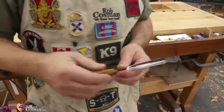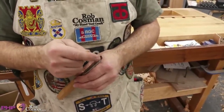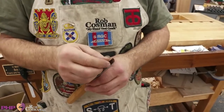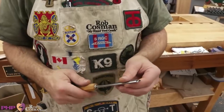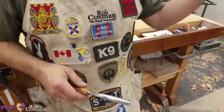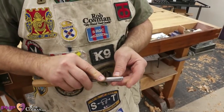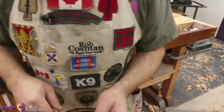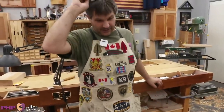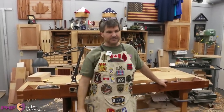Now, if you're buying a slip stone that is a quarter of the radius of this, you're working one little surface and it's not very efficient. Whereas when you can actually match that stone to that radius, it works a lot better. And what I was amazed at is that when we need to sharpen, we go all the way back to the core stone. Chris would simply go in there and rehone using leather and diamond paste or whatever the honing compound was. So I'm sorry, I can't demonstrate that for you, but if you check out that video, you'll learn everything, and I think he's the best at it.